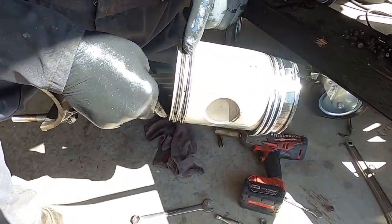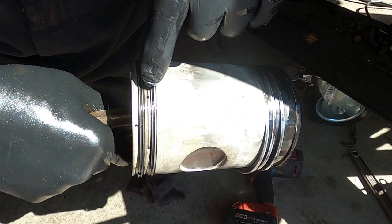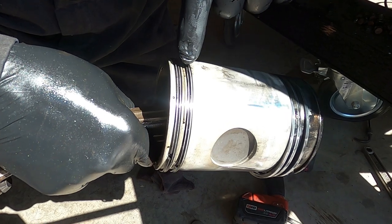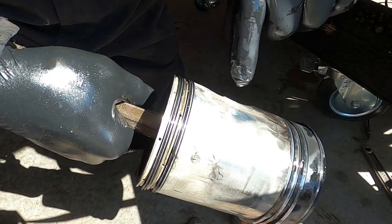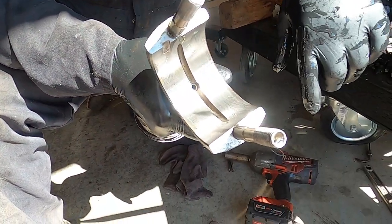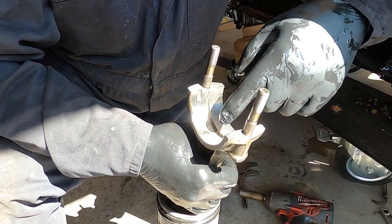These oil holes on the first set of oil rings — when it's turbocharged, there's airbox pressure. You can see how close the liner is to the ring land. When you've got like thirty pounds of boost in here, some of it leaks over into that ring groove. They didn't drill these holes in turboed pistons after a certain year because the amount of crankcase pressure involved makes it a bad deal. See that orifice in the rod in that oil hole? That cuts the oil down going to the piston. They did that on naturally aspirated motors, and by rights on a turboed one, that should be out of there.